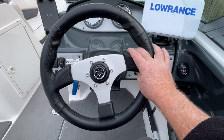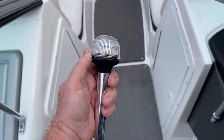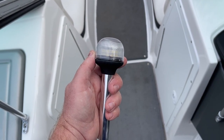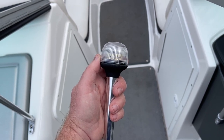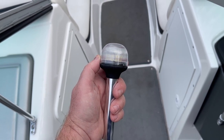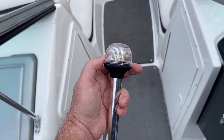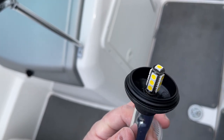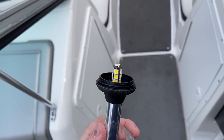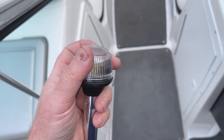We're coming to the end of our tour. Here is my stern pole — our stern light pole, also known as our anchor light. This light needs to be on anytime you're on the water at night, whether underway or anchored. The brighter the better. The stock bulb was a traditional incandescent, and I could see the vibration of boating eventually wearing out that filament, so I replaced it with an LED bulb. It's very bright — plug it in and you can see the difference at night — and hopefully it'll last longer given the vibrations on the water.